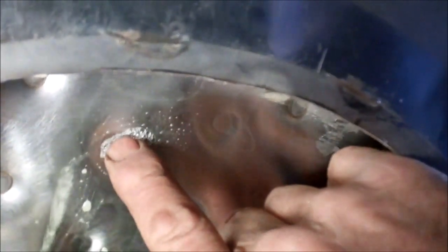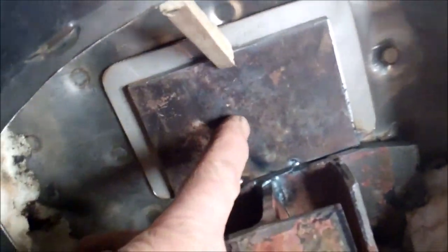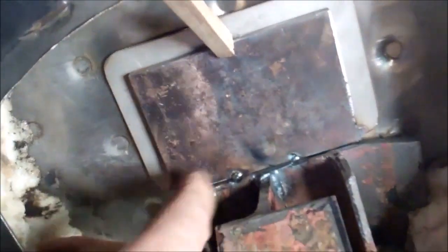It's not as bad a leak as the other side — that's where the leak is. So I'll be welding that spot weld up and I shall also be welding these others. Just started rebuilding the frame, got that plate in place, just tack welded in. I've got two gussets to weld in here.